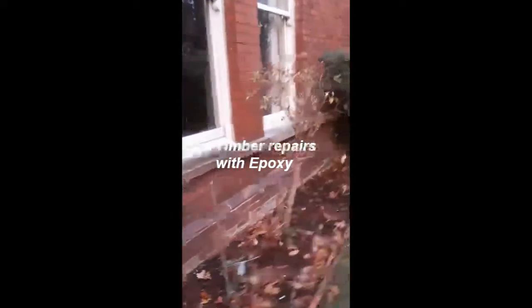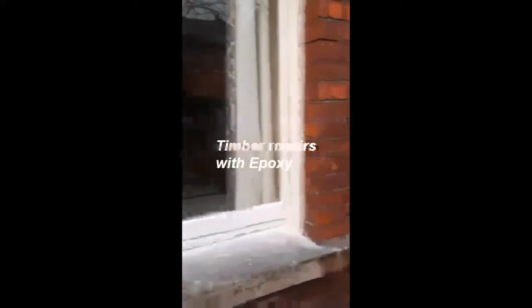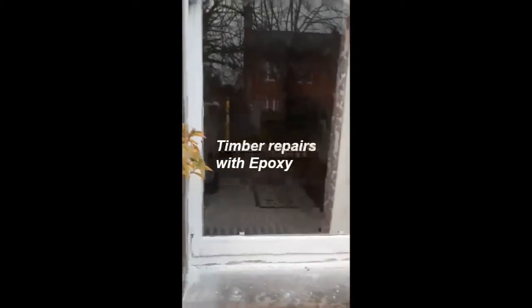And these ones are along the same lines, voids all sealed up, wood hardener on them, and ready to get a primer, which will reveal more issues, but that's kind of what you want to do. You keep on wanting to see more imperfections and keep adjusting them as you go along.